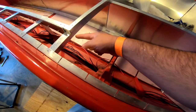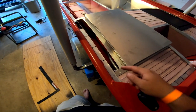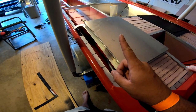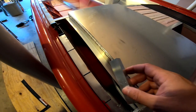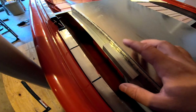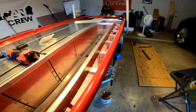Once I make this lid I'll probably be adding some more supports here as well, just to make it all strong. This lid though — I can't really add any support at all to it, but it does feel stronger. We'll add that back piece, get that all hinged together. I can get the square tubing for this lid — since there's no way to add support here or under it, I'm going to add square tubing and then flat bar to the square tubing. The flat bar will go down, making this all super strong. That is perfect.